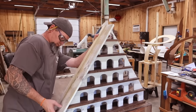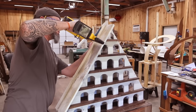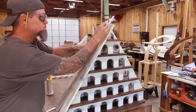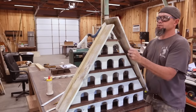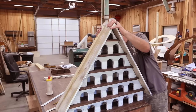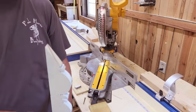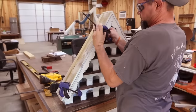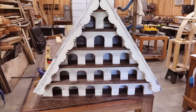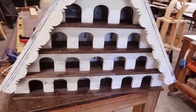On the tips of the roof boards I've put a 21 degree angle. I'm simply going to put glue down both sides and nail this roof board into place. For the front facing edge, I'll use a straight edge to mark it and make sure my nails are actually going into wood and not shooting out the sides. Since I want my gingerbread trim to meet nicely at a point, I'm putting a 55 degree angle on each end. To install these, I'll be putting wood glue on the edge, clamping into place, and throwing some brad nails in. We're finally seeing this thing come together — and it looks awesome.